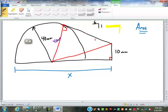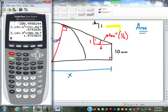Well, we can find this slope here. An angle there, but the angle we can find there would actually be found like this. If I go across here, I can find that angle right there from that. That angle is going to be found because that's a 1 in 6 triangle. Does that make sense? Because of that aspect ratio, this angle is going to be the inverse tangent of 1/6. So 9.46 degrees.